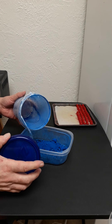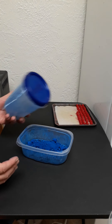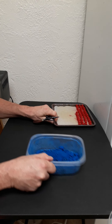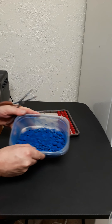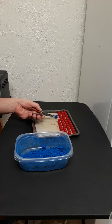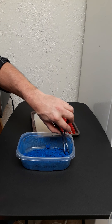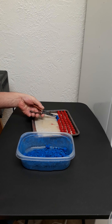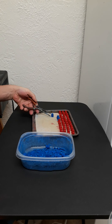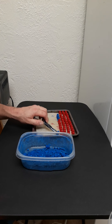My understanding is powder coat powder has a lifespan or shelf life, so to keep that stuff dry is just to your benefit. Now I've got this bigger pile here — I don't even need to shake that off. I just use my own discretion, and like anything, it takes some experience. You don't want globbing of powder on the bullets — that leads to a non-concentric bullet, and that happened to me in the beginning.